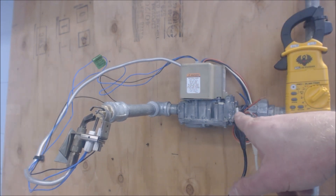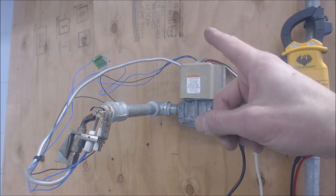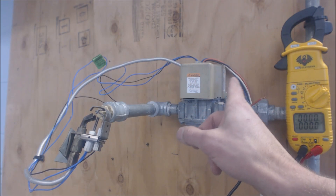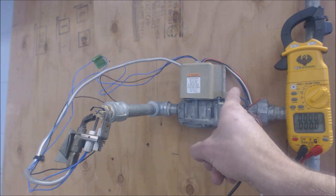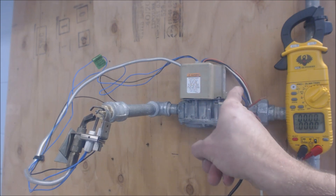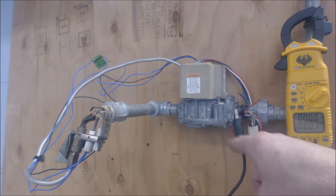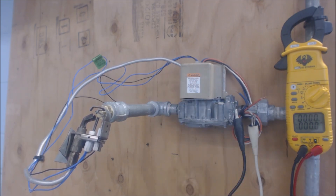Just so you know, power comes to this black wire, then it has to go through a thermostat, then through a pressure switch and any other safety relays and devices like high-heat temperature sensors, before it gets to the blue wire. Once it gets to the blue wire, the ignition process can start — but only when you have 24 volts on black and 24 volts on blue. This is a quick way of pulling your connections off the rest of the furnace just to make sure the smart valve itself is the problem. That's what I wanted to show you today — hope you enjoyed it, and we'll see you next time at AC Service Tech.